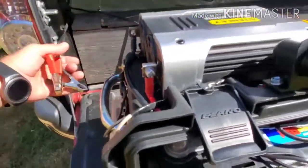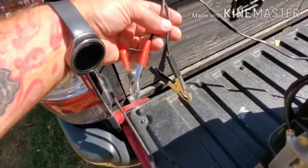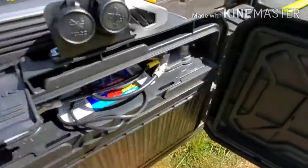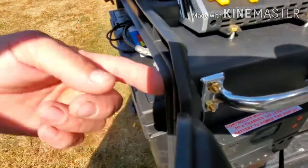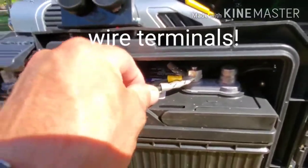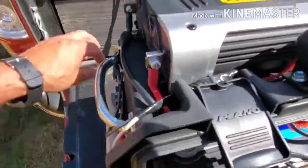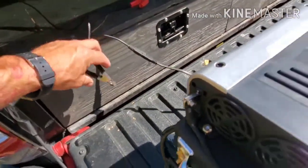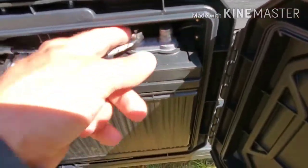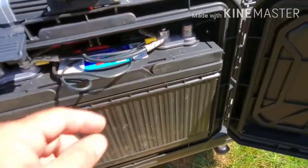Inside, the solar panel controller comes with these connectors, so I cut them off — I have two controllers so this one is for the other. I cut them off and ran them straight in, and just put wing wire nuts on there for a good connection. I also cut off the battery clip connectors that come with it — those are a little more heavy-duty — and put my own ends on. You don't have to do that; you could just clip directly onto the battery posts. I wired everything in directly as well.